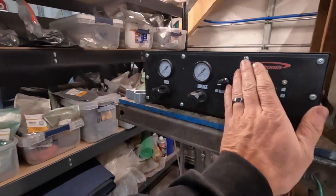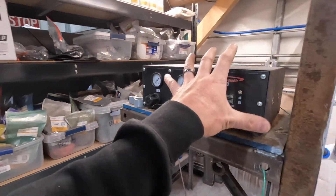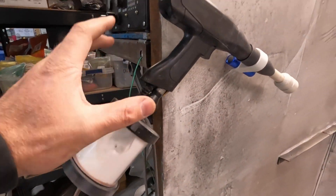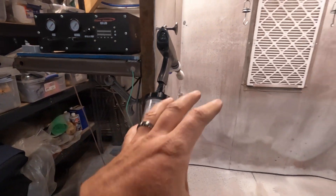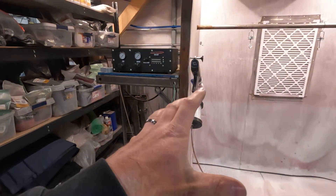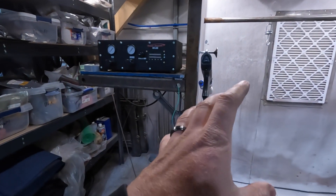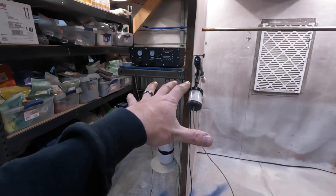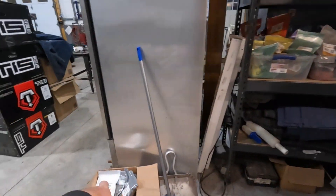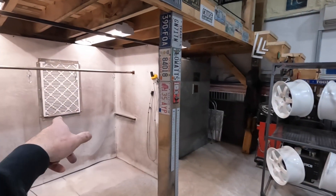We're using the Columbia Coatings Hyper Smooth O3 LED powder coating system — been really happy with it. We've got a shaker for it, and we use our vortex cup a lot unless it's a big job where we load the hopper up. This gun has been a great workhorse. We're actually due for a full rebuild — I've got a complete kit with all the fittings and O-rings. We'll do that in another video, but right now it's time to hang the wheel and get the clear on.